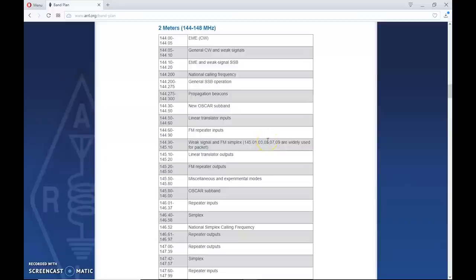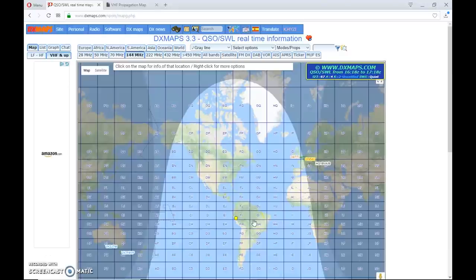We're going to talk about sideband radios versus FM shortly, because sideband radios still go for a pretty dollar. But there are several alternatives using transverters that we'll show you for getting on sideband. The best way to know if the 2-meter band is open is to monitor and listen — there are beacons too. But there are other factors like seasons and conditions we'll talk about.